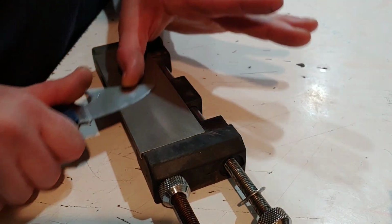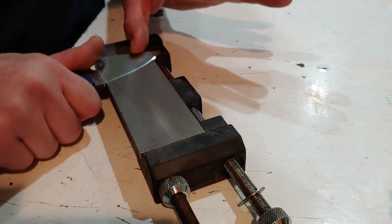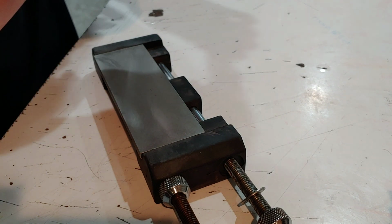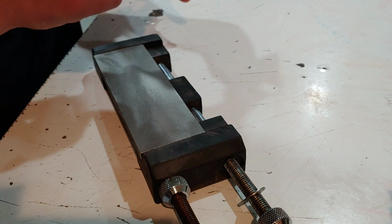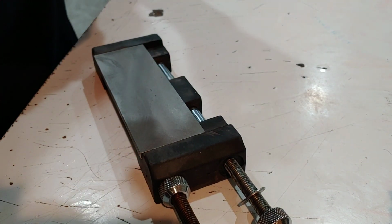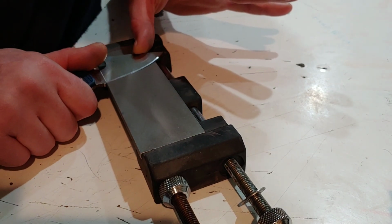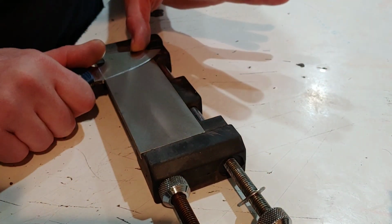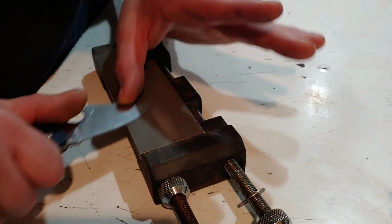Every time I've caused fatigued steel, it's because I've spent too much time on the stone or on one side of the knife, and I didn't get it perfect, and I just said, it's good enough, rather than continuing or taking a break and coming back and finishing it. But you're going to run into all those little tiny things as you learn to sharpen.